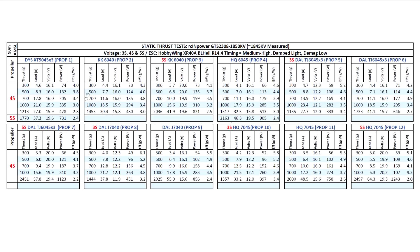This is a large stator — the motor is hardly ever getting stressed with some of these props, especially 5-inch props. On the 5-inch props I just tested the YS5045x3, because this is quite a large motor and I wasn't sure a 5-inch prop would match well. I think 6-inch and 7-inch props would be a better match. But on 5S with the tri-blade 5-inch, pretty good thrust at very reasonable amps — 1770 grams at 37 amps, so that's quite efficient.